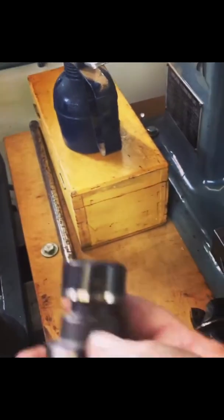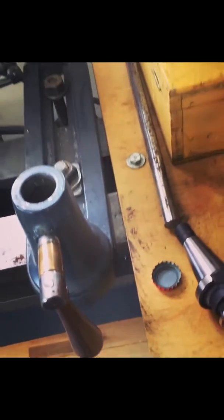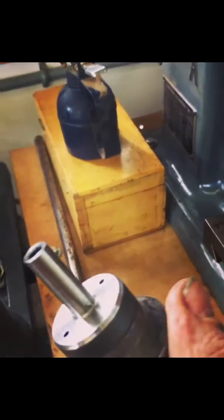I've picked up some NT30 tooling tapers. Obviously they're not going to fit the BCA milling machine, but this is hardened — and it's the first time I've ever worked with hardened metal. I got it down to within three tenths of a thou, so that used to look just like that. Great to have a little fly cutter here with insert tooling, which would've been garbage otherwise. And so that fits into my cutter — pretty amazing.